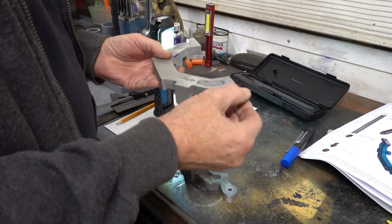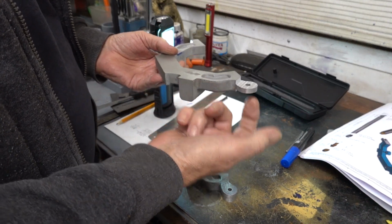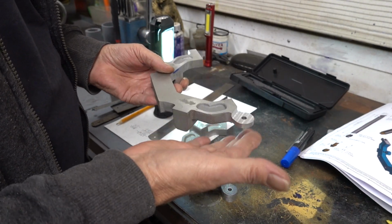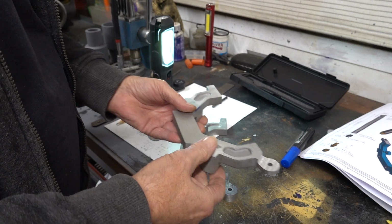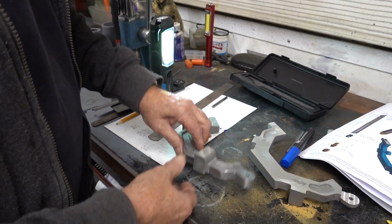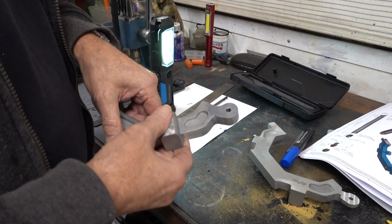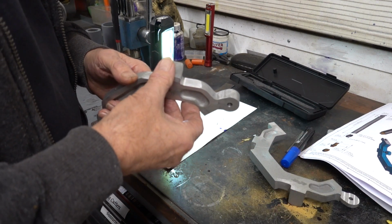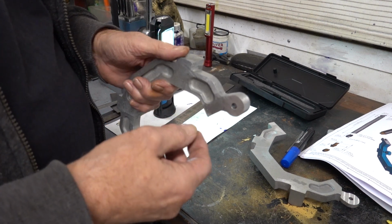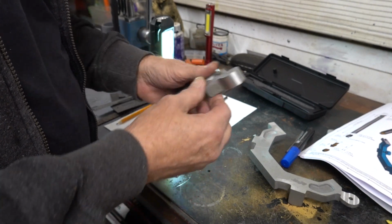The only thing was there were a little bit of spring with it that way, because it was sat on pads, and I ain't got any machinist jacks. It'd have to been a real dinky one, wouldn't it, or some sort of packings. I did feel a bit of vibration, that's why I kept the cuts as shallow as possible. Because we're not in any race here. The thing is to get it accurate, and hopefully it'll turn out well. So tomorrow I'll come back in and I'll set it all up again to do this slot.